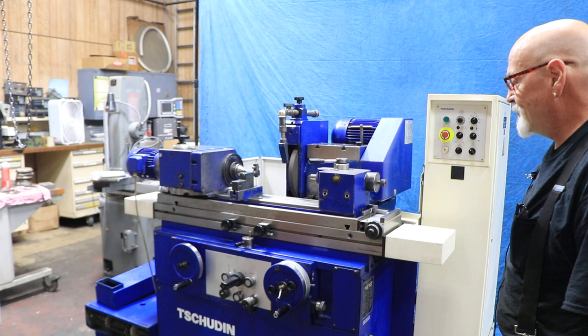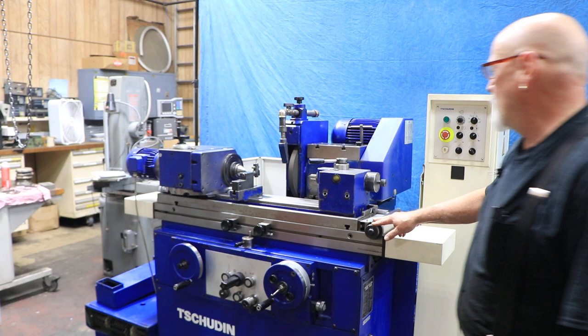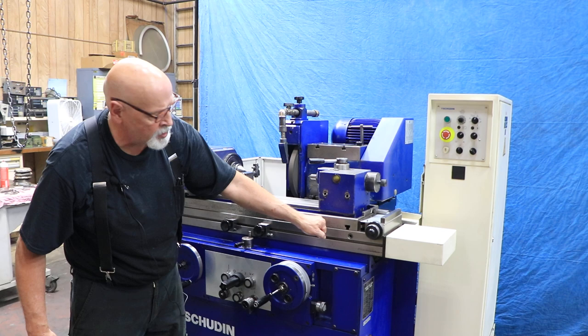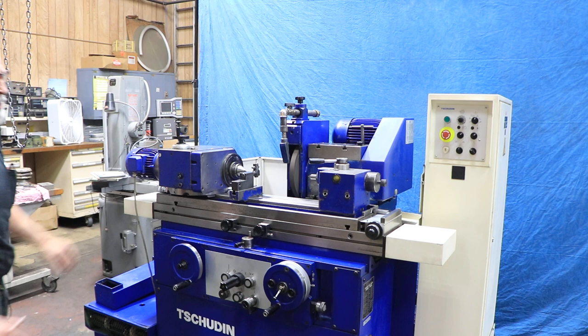This here is for adjusting the table taper. It doesn't have little clamp-down things like most machines — it has eccentric little pins in here. You put your Allen wrench in there and just loosen that a little bit. It's a cam, and you loosen a T-nut, and that's how it slides in and out. It's nice and clean and stays clean.